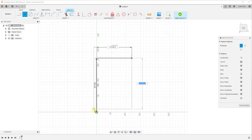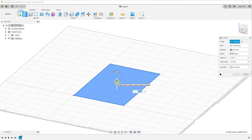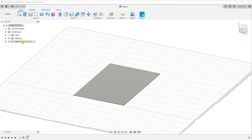I drew a line along this axis and then another line along this axis. For now, I'm not going to model out too much floor framing — we're just going to give this a little bit of thickness as if this was a three-quarter inch sheet of plywood. I'm going to use the extrude tool and extrude this up three-quarters of an inch. I'm going to call this 'base flooring, 15 feet by 10 feet.' We're going to right-click and create components from bodies, because we want to model these out as components.